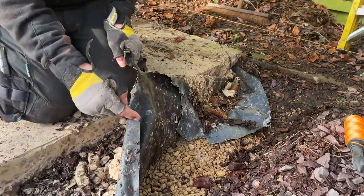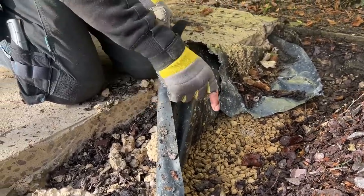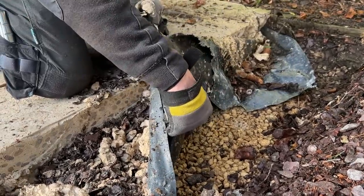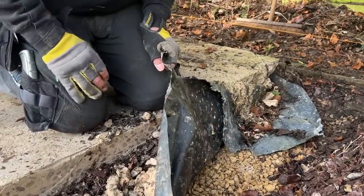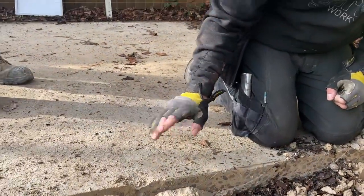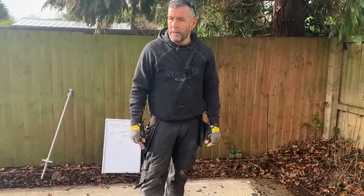But that's what you want to do — you need to dig down. That's about four, five, six inches; he should have maybe four inches of stone on there, and then you want your visqueen. A blinding of sand on top of that stone will stop any stone penetrating the DPC, which will stop any damp coming up through the damp proof membrane. But of course then you need your insulation on there as well, and this is a very level plot. If your garden slopes, a concrete pad's not really for you.